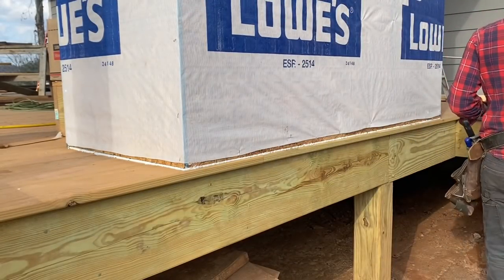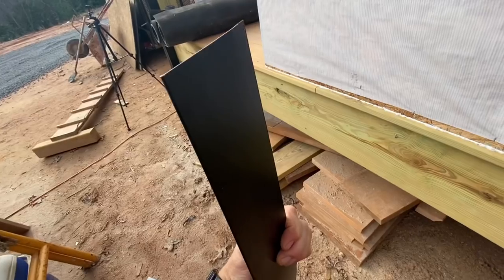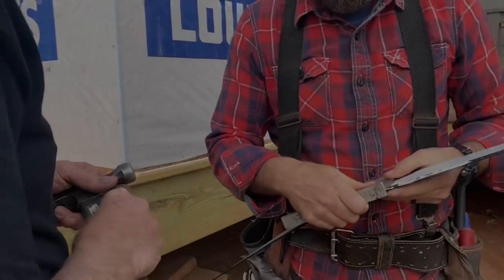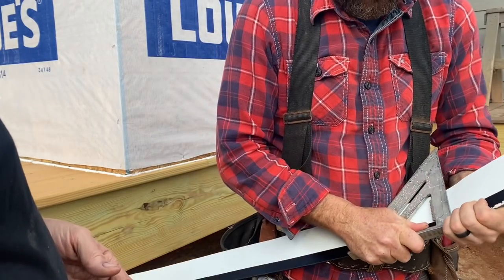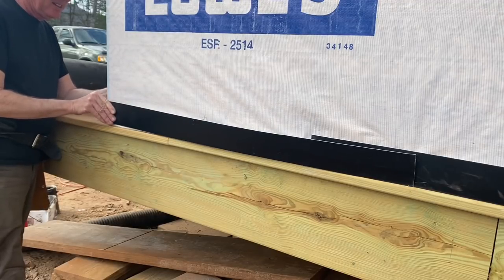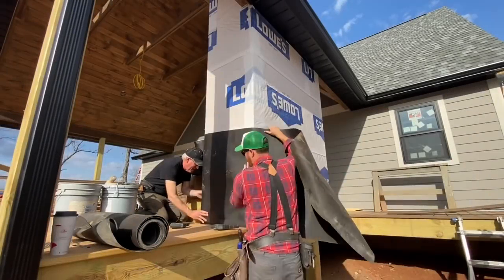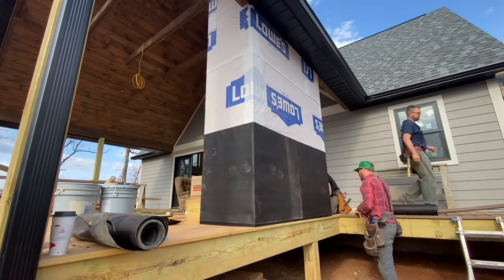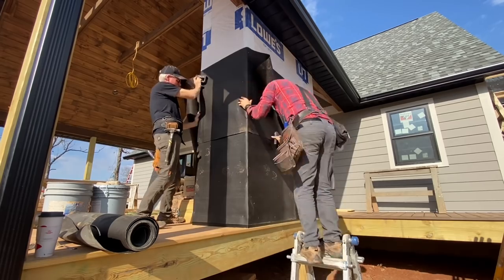Next I had to finish the prep work on the fireplace before installation. We'd left the OSB sheeting off the deck by a quarter inch and caulked that gap so no water could run under it. We put a hemmed edge on some three-inch tall black flashing and installed it with roofing nails, leaving a half inch exposed so the barn wood wouldn't touch the decking. To add another layer of weather protection and provide a dark backing, we installed leftover 30-pound roofing felt on the chase — an important step because gaps in the barn wood would stand out like a sore thumb against a white background.